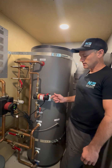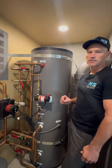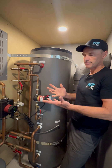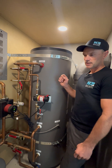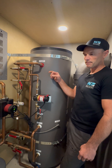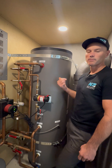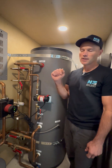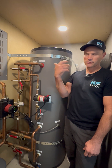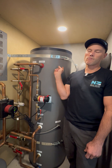These are pretty cool. I highly recommend them in everyone's house. This gives you instant hot water at your fixture, so if you're at your kitchen or anywhere, you've got hot water. We run a loop around the house to the hot water line and back to the hot water tank, and this pump is just continuously pumping hot water around your house, so when you turn on your shower or anything, you don't have to wait for the hot water to run from the hot water tank to your fixture.